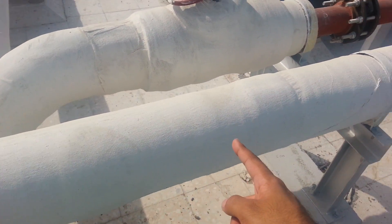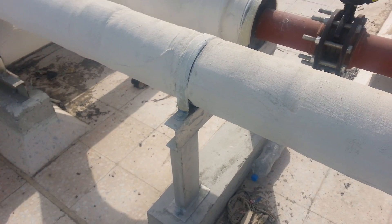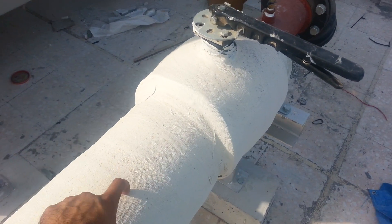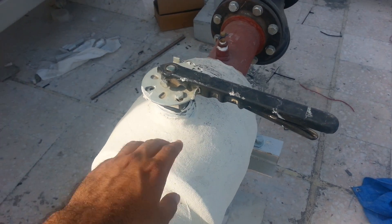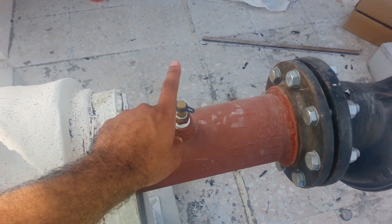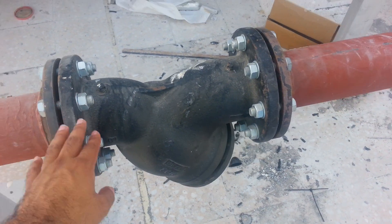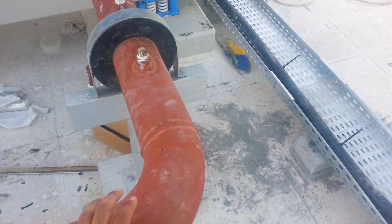You can see the return line going into the chiller. That's a clamp, that's a channel support we have provided. This is foster insulation over it and aluminum cladding will come as well. You can see it's a butterfly valve — a normal butterfly valve, not motorized — and over here a pressure testing point. That's a strainer, a four-inch strainer on a four-inch line.